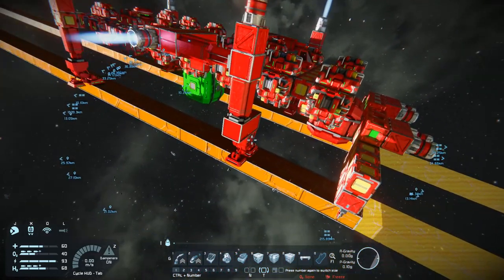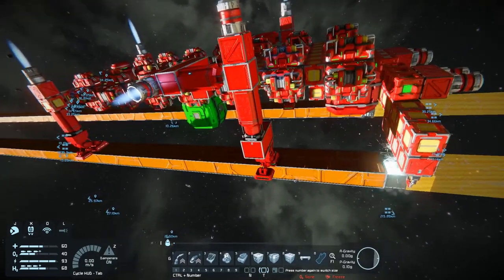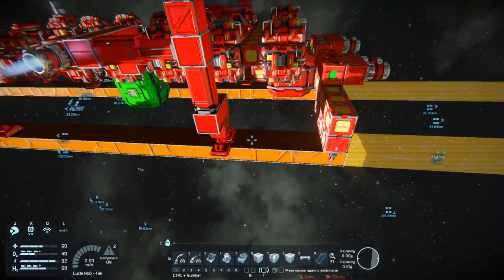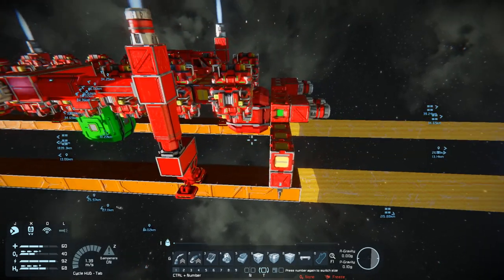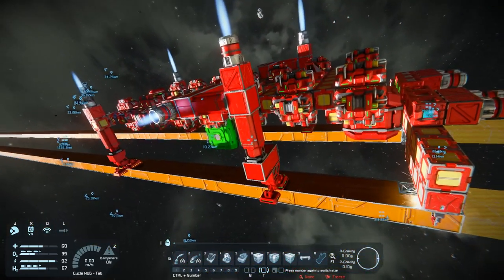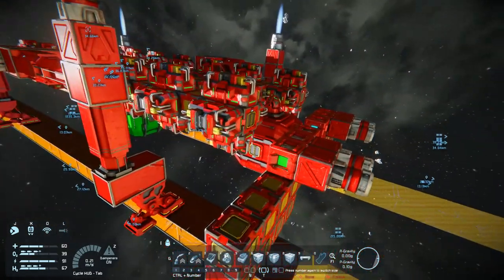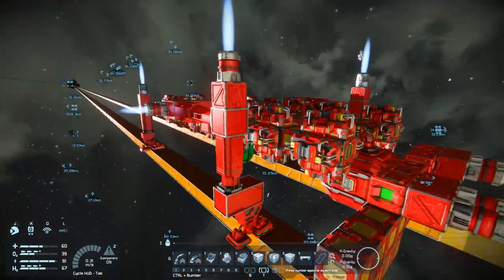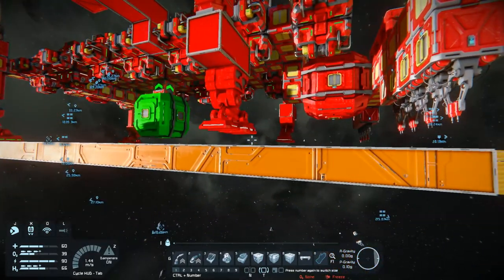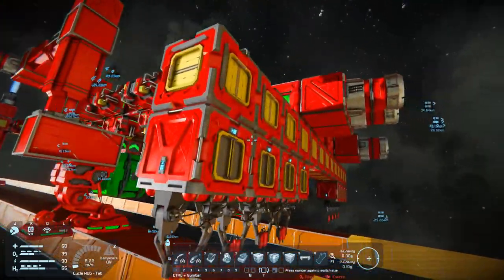These thrusters are here just to prevent the slow drift that's been coming from the rails. What was happening is it was getting about a millimeter higher every stroke, until it got to the point where it wouldn't lock anymore. So I've taken them off the timer and just left them on all the time, and it's been holding the gear down pretty well — still drifts a little bit, but manageable.